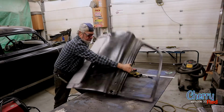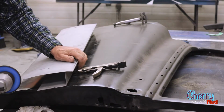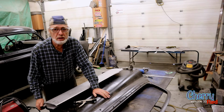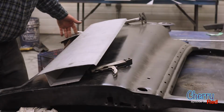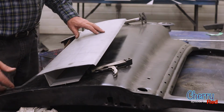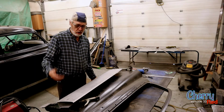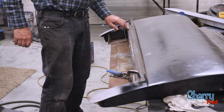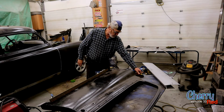So all we have to do is trim this a bit. Again, the trick to an accurate job is to treat these corners that are later going to be cut off as though they're going to stay there. So we match this up to that corner perfectly, and we cut it off later, but then we match the new piece up to here perfectly. And perfect plus perfect equals perfect. That's going to give us a guaranteed straight. Very needed.